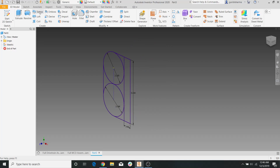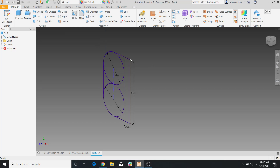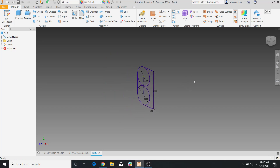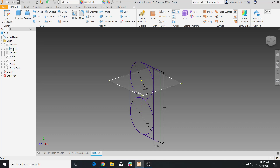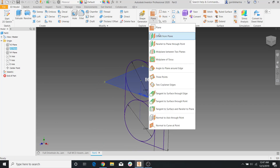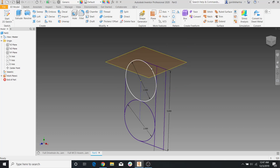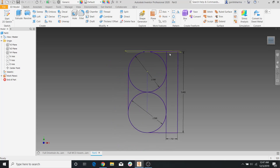What we want to do now is take a look at the sweep tool — we want to sweep this whole bumper profile along a path. If you look at the picture, you can see that the red line is connecting to the corner of the drawing. So we need to create a path and connect it to this point. Now normally we would start a 2D sketch on a plane, but there's no planes to be found. What we need to do is open up the origin — we can look at the YZ, XZ, and XY plane. We can take this XZ plane and shift it upwards to meet this point by going to the plane dropdown, offset from plane, shifted up 1.25 inches (2.5 divided by 2). I can see that this plane intersects the lines at the top.